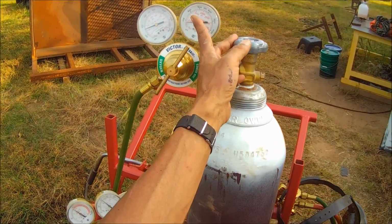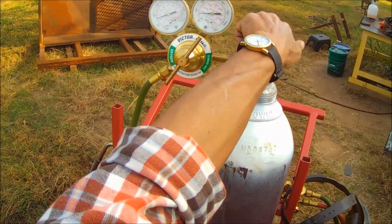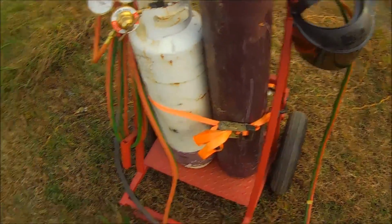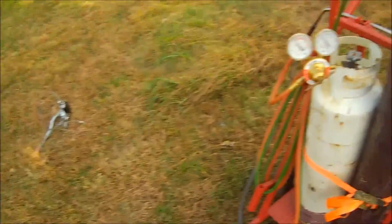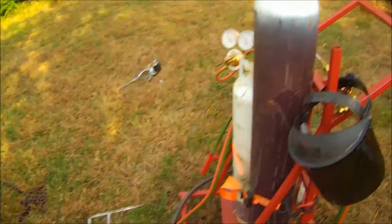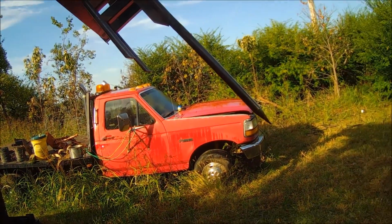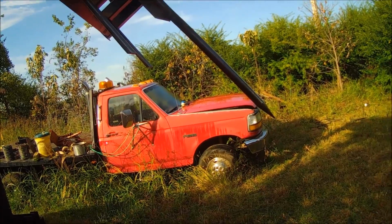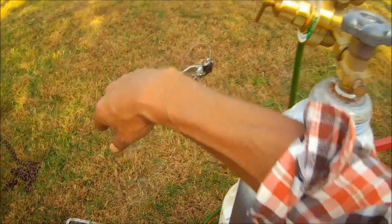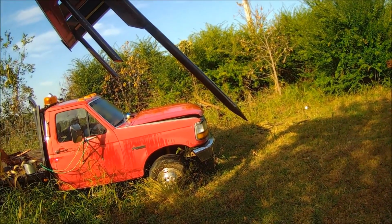We started out with about 800-900 pounds on the meter. I'm at 400 pounds now, and you saw how very little it ran. It's an expensive little setup, but the alternative would be to manifold a bunch of acetylene bottles together in order to keep your draw rate safe. And you know, it wouldn't be satisfactory. That's even more expensive. Like I say, but anyhow, there you got it. And this will probably be part of a series one of these days on heat shrinking.